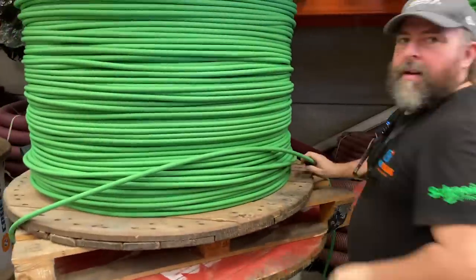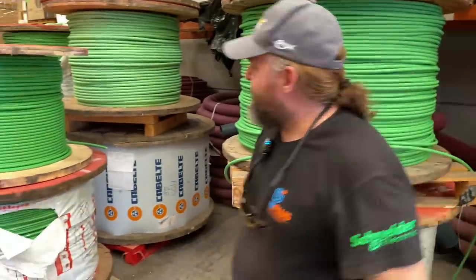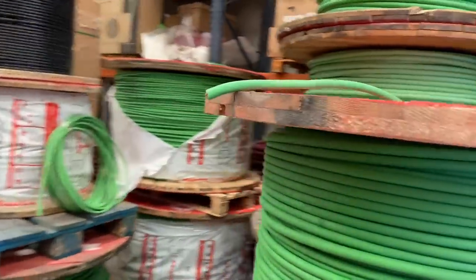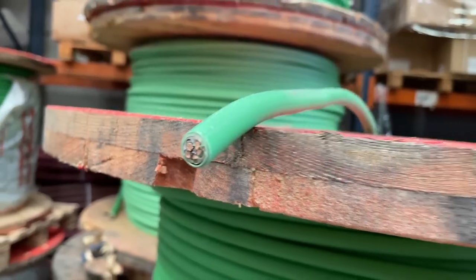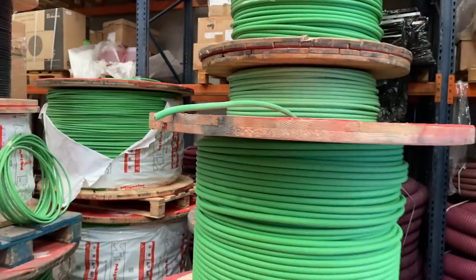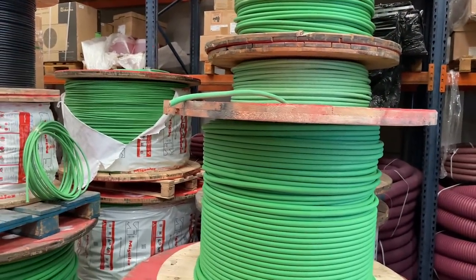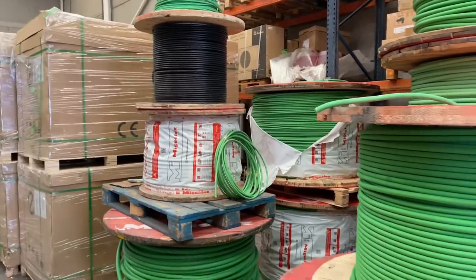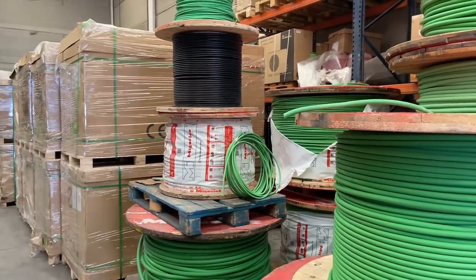That would throw us a little bit, remembering back to the older days when the CPC was green. Those are the differences between the installations. So if you're not using conduit, you'd be using this, yeah. So main cables, like what we saw yesterday, to the head unit, are always running this single core.